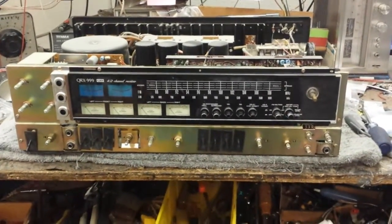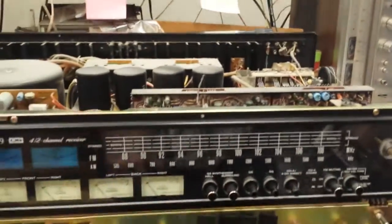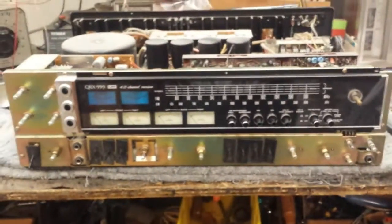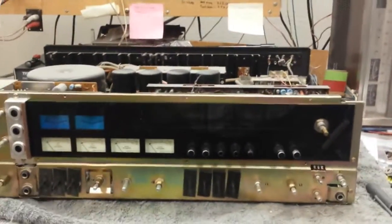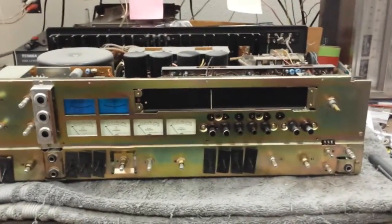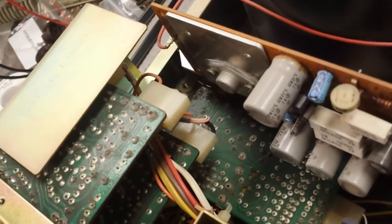The next thing you're going to want to remove is the dial glass, which is done with screws underneath here and up top here. However, this whole thing comes off as a unit, and then we'll focus on removing the lamps. Once you've got the dial glass out, you'll see the black tuning face — just grab a hold of that and remove it as well. Now we're down to the bare faceplate. There's a shield on the left side for the tone controls. You're going to need to remove that and unplug the tone control boards. Mark which one goes on the top and which one goes on the bottom — there are two connectors per board.